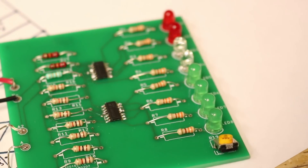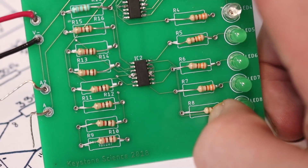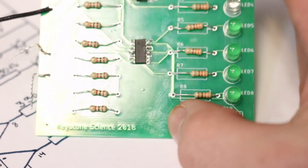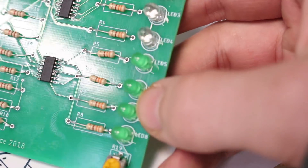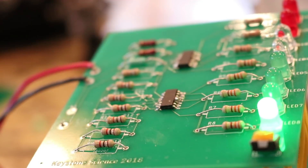Here's the entire circuit all soldered onto the board. Admittedly, I did make the spots for the resistors a bit too big — I made them for half-watt resistors, but really these are all quarter-watt resistors, and there's no need for them to be that big, though it's not a problem for the circuit's functionality. You can see I put the potentiometer down here with the LEDs going up — greens at the bottom, then whites, then reds. With it all connected up and with slightly more powerful audio input, you can see the full spectrum of the LEDs. You guys should definitely go check them out — I'll have their link first thing in the description below. I'm going to get some of my older circuits put onto PCB boards.